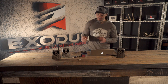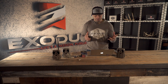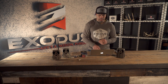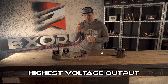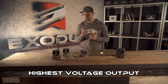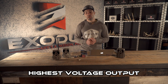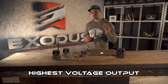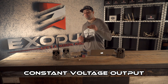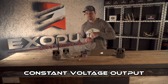Other advantages to lithium batteries include lifespan and — most importantly — consistent voltage output. A lithium battery starts at 1.7 volts at full capacity, which is 0.2 volts higher than alkaline and almost half a volt more than a nickel metal hydride rechargeable. With lithium batteries, you see a constant voltage output all the way out to 3,000 to 3,200 milliamp hours before it starts to decrease.